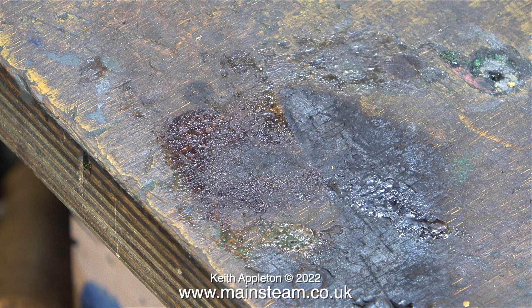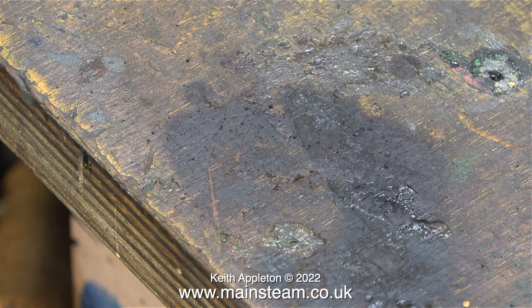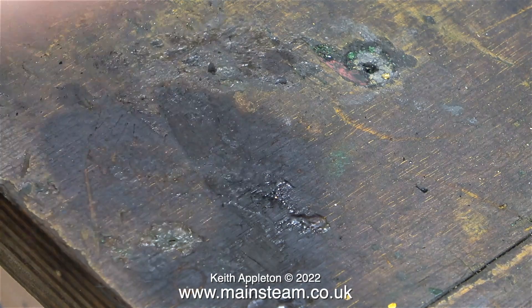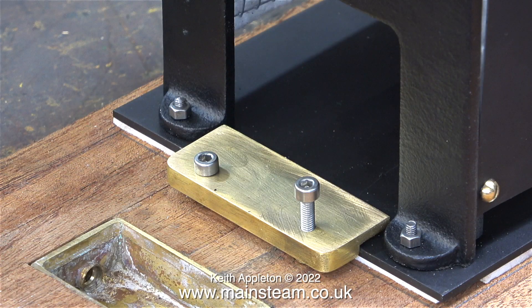It doesn't matter — this is a very rough work surface on the bench and it's ready for refacing anyway. I just wanted to show you how easy it is to set fire to your bench. Using a cloth I cleaned off the black carbon deposit and it wasn't really badly damaged, though it was quite hot. I re-threaded the holes M5 at this end of the boiler, tried the bolts in place, and they were both okay.